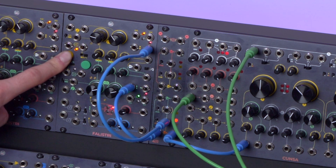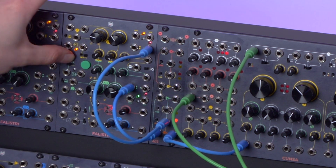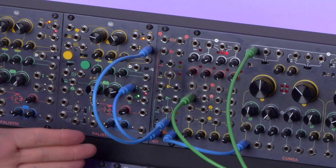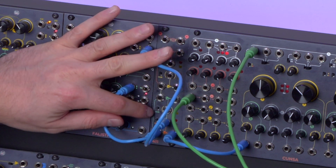If you compare it with the unmodulated version, this one will sound a bit squared out, a bit chopped. The reason is that this envelope goes from 0 to 10 volts and will thus make this circuit saturate a little bit. So we can use the switch to halve the control signal's amplitude.